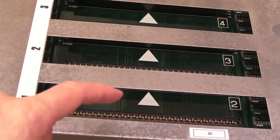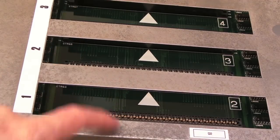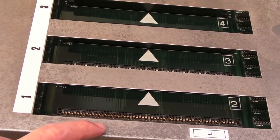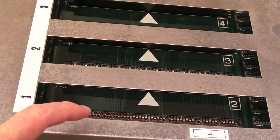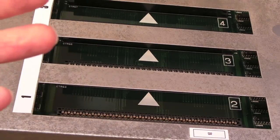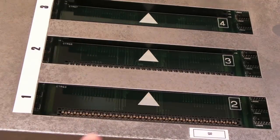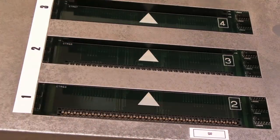And one thing that seemed to coincide, all these problems started about a week or two after I did the electrolysis on this shell. So whilst I'm sure the shell's okay to handle, the point I would make is be super careful when you're doing electrolysis. Make sure you're in a proper well ventilated room. Make sure you wear breathing apparatus, a breathing mask or something like I had on when you're sanding down the shell here, because you're going to get particles. I think I was sanding it down when there was carbon on there, but you're getting bits of metal in there, and if you breathe that in, that could cause you some problems.